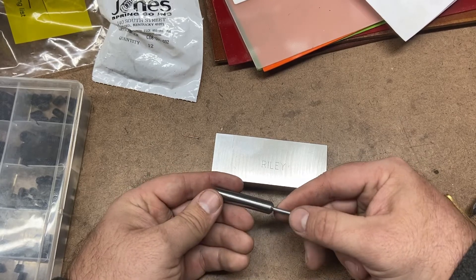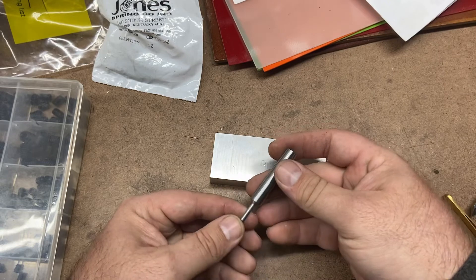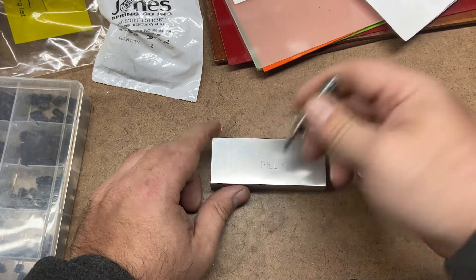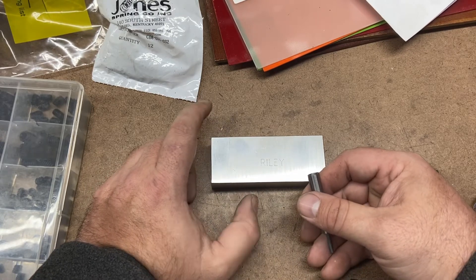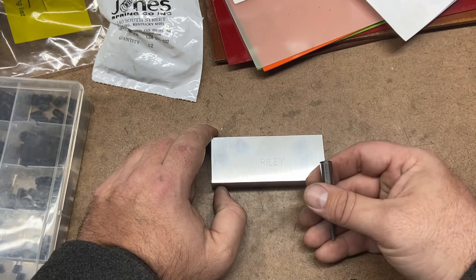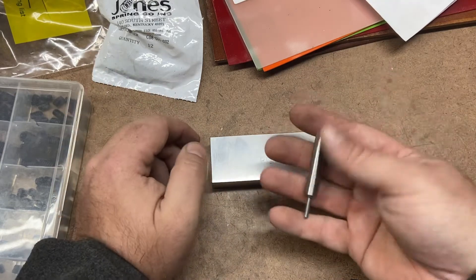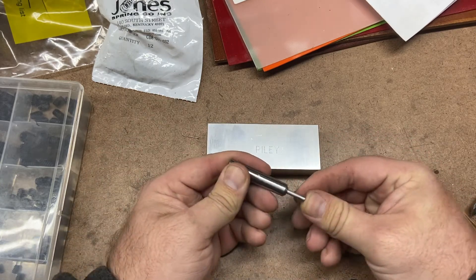Most of you probably already know what this is — it's a CNC drag bit for CNC engraving. It's a spring-loaded point that chucks into your CNC spindle and pushes down into the material you wish to engrave, and then your toolpath takes care of the rest. John Saunders does have a very good little engraving video — a Widget Wednesday — where he shows the Tormach equivalent of this bit and how he programmed and set everything up on a powder-coated piece of aluminum. I'll try to link that in the description below.